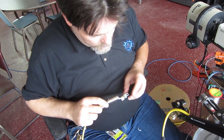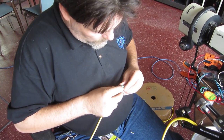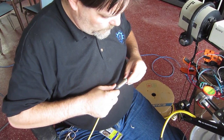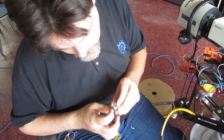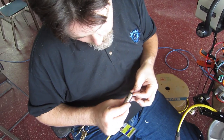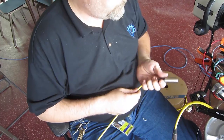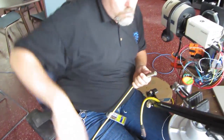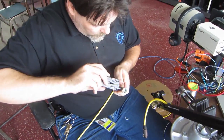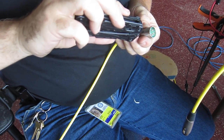Now the connector is keyed, so you put it in, put the cover on the right direction. This thing is really hot still. But now you notice there's a little ridge right there on the connector, and there's a key. That's so that the retaining screw will actually line up properly. And then you simply take your tool. You tighten it, it actually comes out and locks to the inside of the connector.